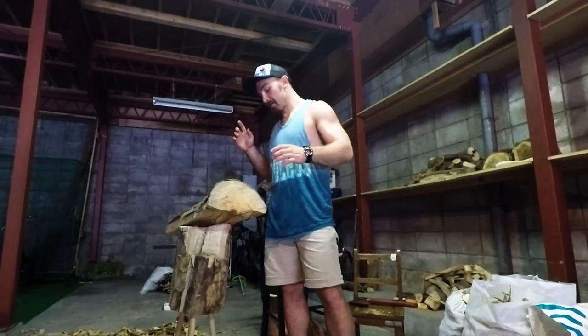Because the environment in Japan is very moist, very humid and hot - actually extremely humid and hot right now, that's why I'm in tank tops and shorts. This log kept the moisture quite well over the last few months, but it is not carvable anymore. Especially fruit woods like pear, apple, and plum are quite hard in the first place. You want to carve them when they're green. When dry, they become extremely tough and very prone to cracking, and the edges will just roll.